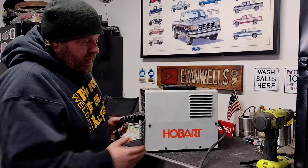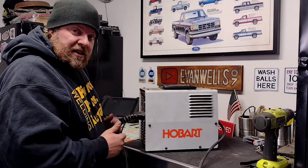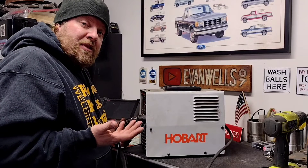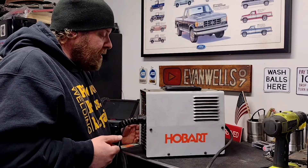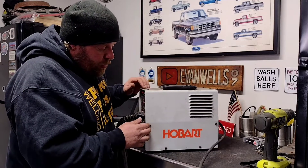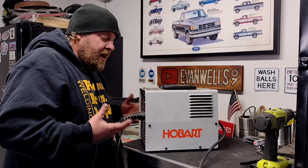Right here is the intake fan — it's got a little PC-type fan behind it that draws air in, a little air compressor down here, and then exhaust vents for the hot air coming out. Be aware that some of what I'm going to do is probably not recommended by Hobart and will more than likely void your warranty. Fortunately for me, I've been out of warranty for probably a decade. What I want to do today is clean the exterior, pull all the case screws, blow all the dust and debris out of the interior, and look into why this thing's going into protection mode.